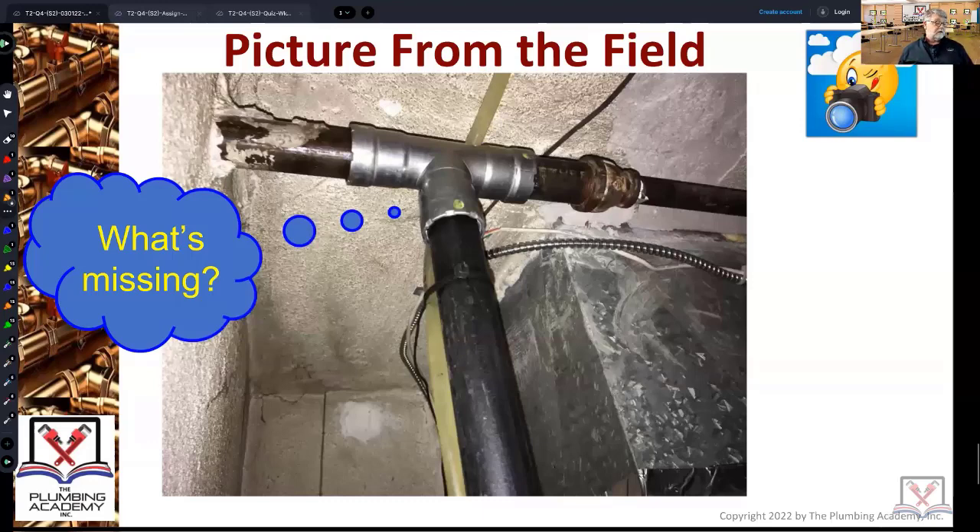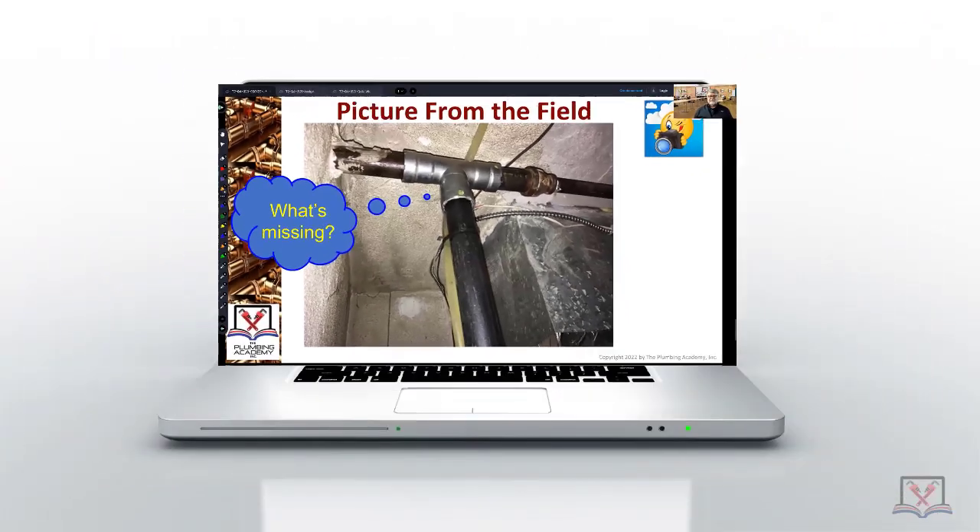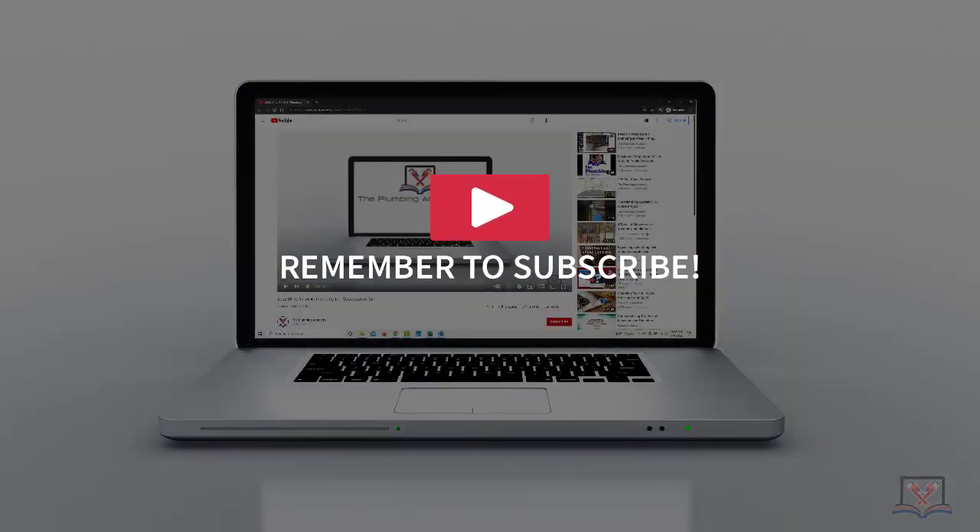Taking this picture, looking at that, and interviewing the plumber — looking at some of the work going on there — what do you see? I see open wires, I see a condensate line running by that's not well supported.